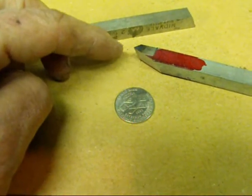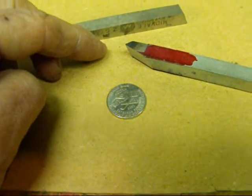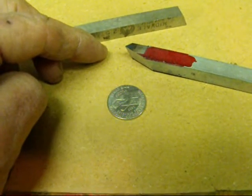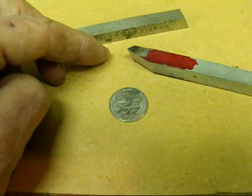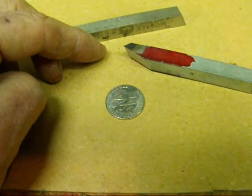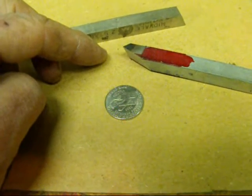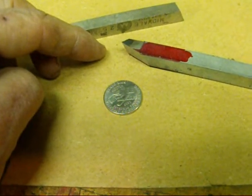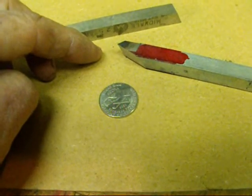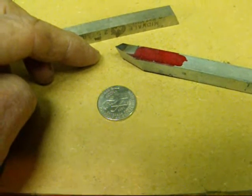I'm at the end of the video here. I'm going to take some close-up stills of this because this is about as close as I can get with the movie camera and I know that you can't see some of the details. I hope this helps you as you grind your lathe tools this winter — get a nice keen angle on there, get a good cut, and when your chips come out and curl off real nice without making a lot of noise, you know you're getting a good cut. This is Tubal Cain saying so long for now.